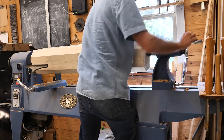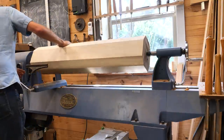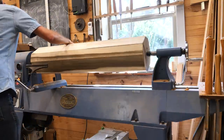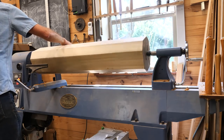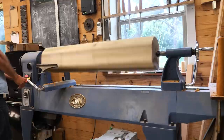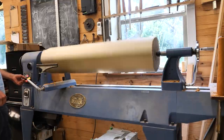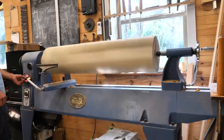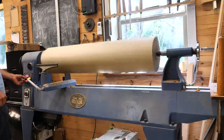As I rotate it, even on the marks that I originally made, I can tell it's quite a bit off balance — watch how it falls to the same spot every time. It's just hard with that big of a piece to get it balanced. The key is to start slow on your speed and slowly crank up until you get vibration in your lathe, which happened pretty quick here. That's your sweet spot — once you catch that vibration, back it off, and then you can start turning.